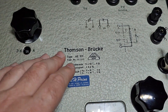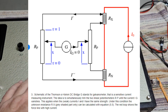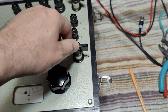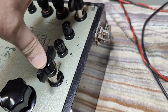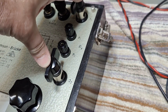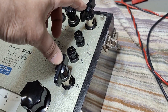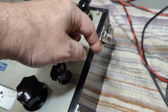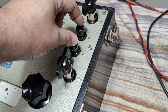I should show a little principle diagram of a Thompson bridge. The main idea is that we can pull a huge current through the unknown resistor, and we're doing this here. Look at those big, hefty screw terminals — here is the main resistor mounted, and then the sense point. It has to be like a Kelvin resistor, a 4-wire connection to that resistor. This is where the current flows, and these two go to the resistor to compensate for the loss in the wires. This is how you measure the voltage over the resistor that you want to measure.